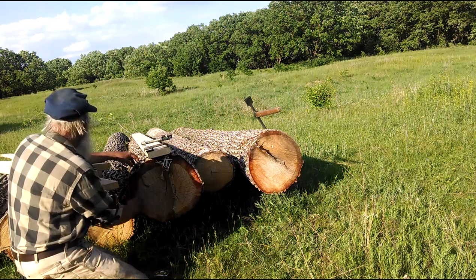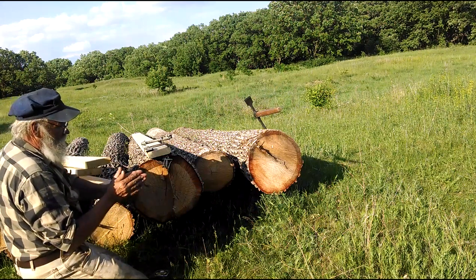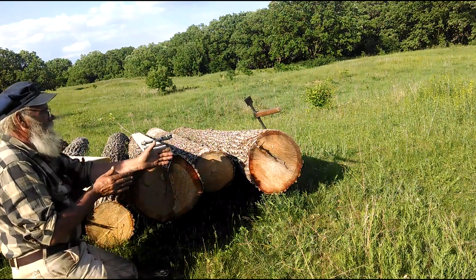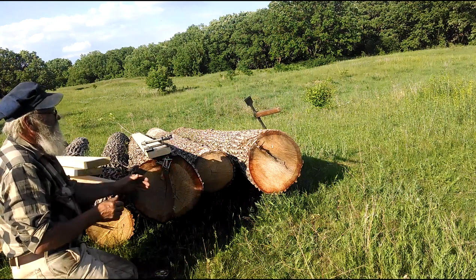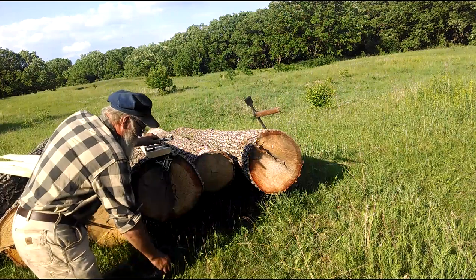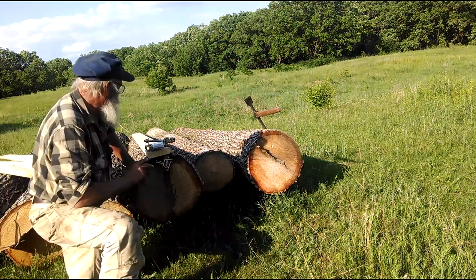It's going to be some good lumber. I'm trying to go center because if you were to split a log, it's like a stalk of celery — the tension is on the outside and it'll bow. So you really want to keep it centered. Then all you have to worry about is, if it's green, as it dries it'll tend to want to twist a little bit. Not much — oak isn't too bad as long as they're centered. But that's what the dimensional lumber is for. Once I get them cut down they'll be much more manageable, because trying to build with a log this big is a hell of a lot of weight. On oak I'll end up with six inches.